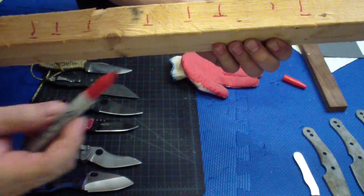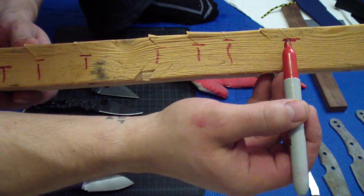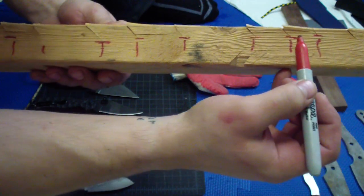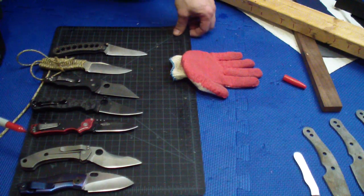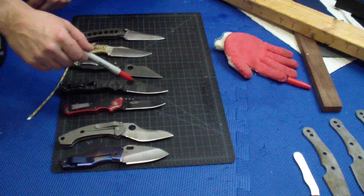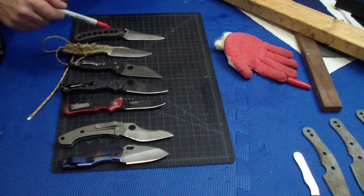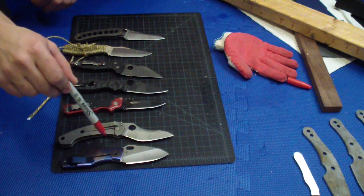Here is a little better. Let me turn it this way, and you're going to get a better idea. Look how shallow you start, and as I went with the blades, I purposely put them on what I expected them to cut with. I did some of them before, but you see how it races up. So you start with the hollow grinds, absolutely the worst cutting ability in this. Then you go to the flat grinds with secondary bevel. The smaller the secondary bevel and the thinner the edge, the better the cutting performance. And then convex. Even the really thick stack convex still outperforms the cutting capability of the knife with double the hollow grind.